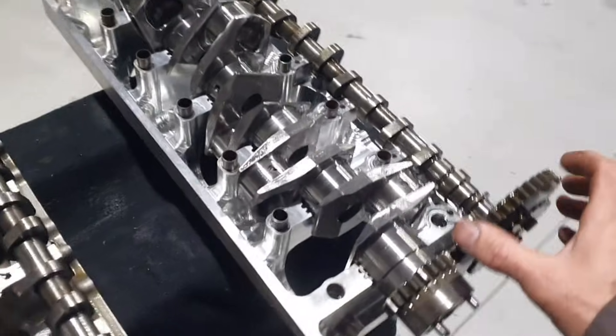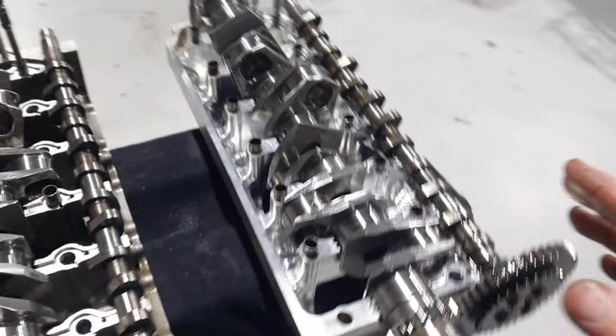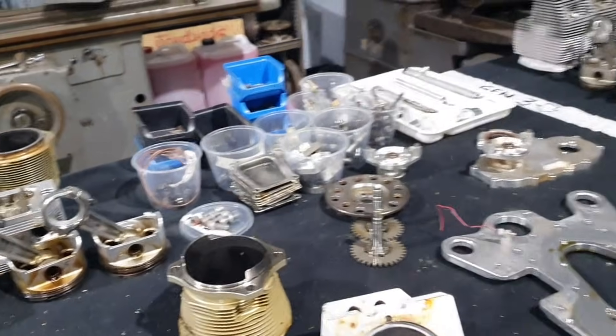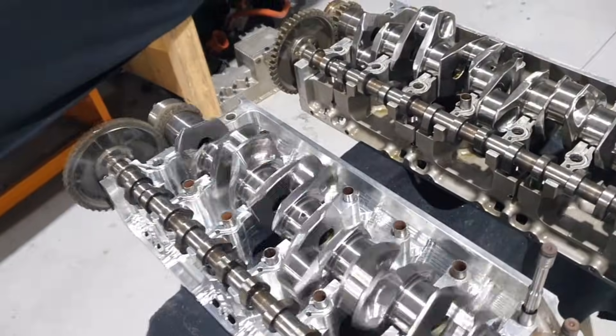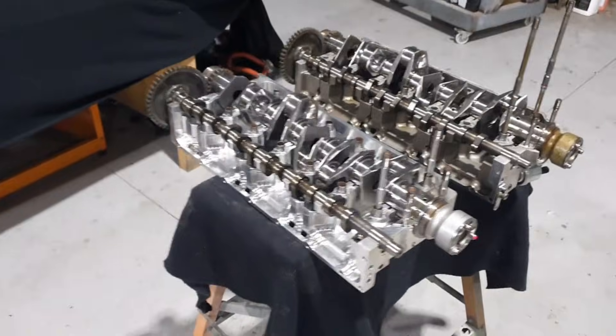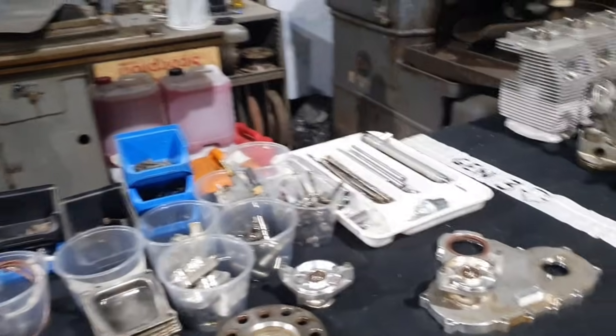The big takeaway is really the crank - the interior of the engine is identical. The crankshaft and the camshaft interchange, and the engines are very similar. I think that covers all the comparisons I needed to see, particularly with this bottom end being the same. Jabiru might have a million things I've missed, but at face value this is what I've detected. I don't think so - I think the bottom ends are very similar.